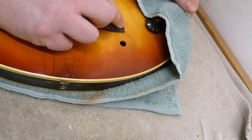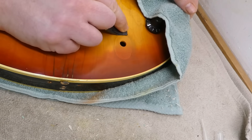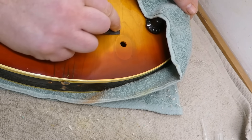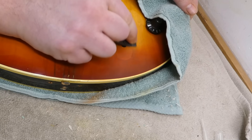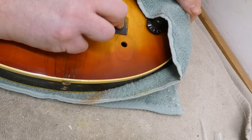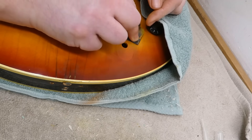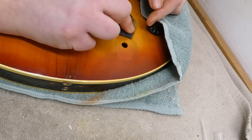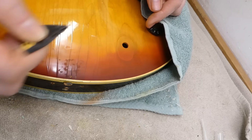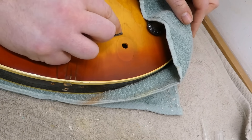What's nice about using the airbrush with a light touch is the finish is sort of atomized — sprays in a particulate way. It's almost like dust when it lands on the surface, so it doesn't really melt deeply into the previous surface. Like if I laid into it with a really heavy coat, it would melt the previous lacquer significantly and mix with it.